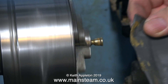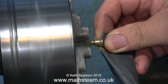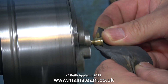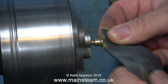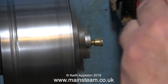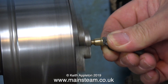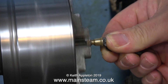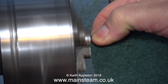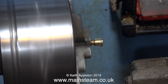A major health and safety warning: my hands are very close to the chuck, but just close enough. Any closer and I will have a health problem. Actually the camera angle makes it look worse than it is, but if you're doing a job like this be very, very careful. This process may help illustrate why I do not wear gloves in the workshop - I can see exactly where my fingers are. If I was wearing gloves, they could get caught up in the chuck and pull my fingers into it, and then it's an afternoon in A&E.